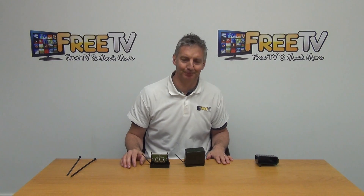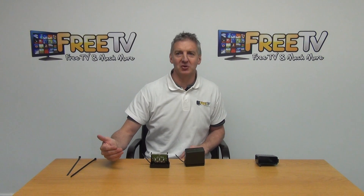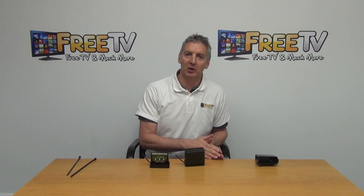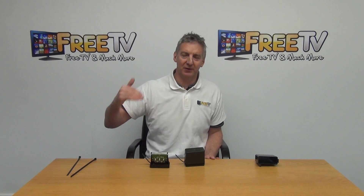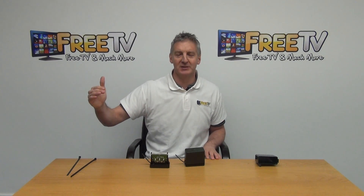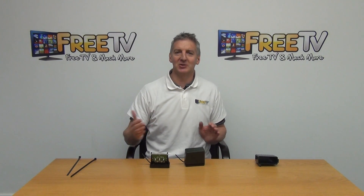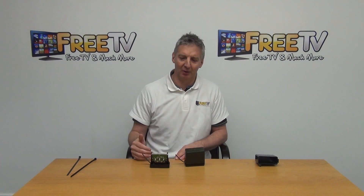There are two variations of this unit. If we think about it — say you're living in Wexford and trying to pick up a Freeview signal from the UK — well, you probably won't need to amplify your local transmitter aerial because you'll probably be quite close to it. A standard UHF aerial going directly to it will pick it up. But if you're trying to aim the second aerial towards Wales and it's 100 or 200 kilometres away, you might need to amplify the signal.